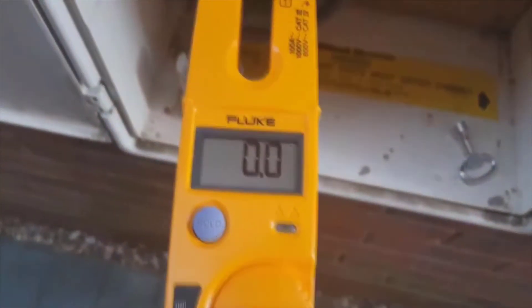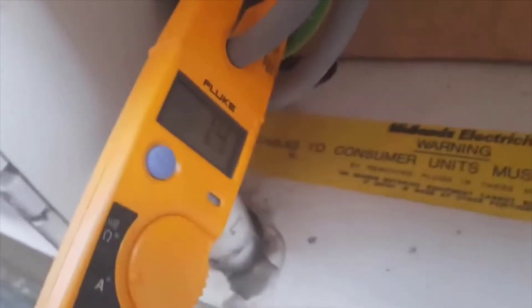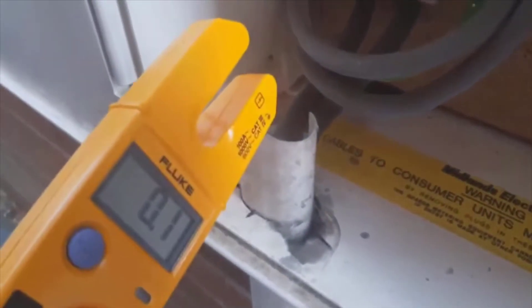So now I'll explain how we test the current, the amps. So basically we set it to A on the meter — that simple. We set it to A using the open jaw technology. We find the mains live cable and we basically just slide the jaw over the top of that and we look at the meter and we say, oh it's 1.4 amps. And then we take it off. Oh dear, we've lost what it says on the display.